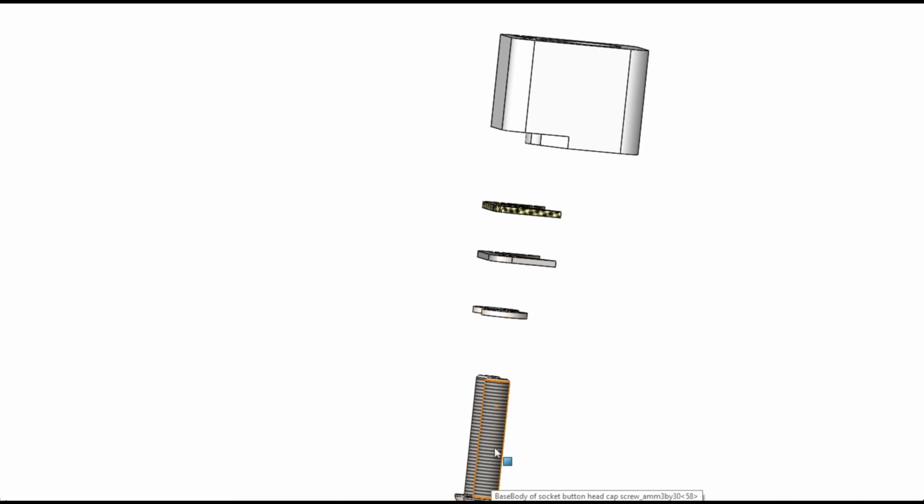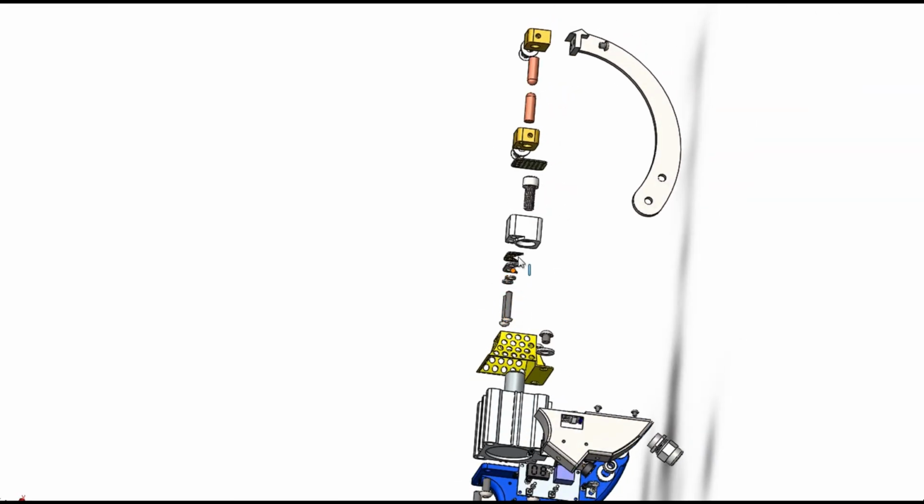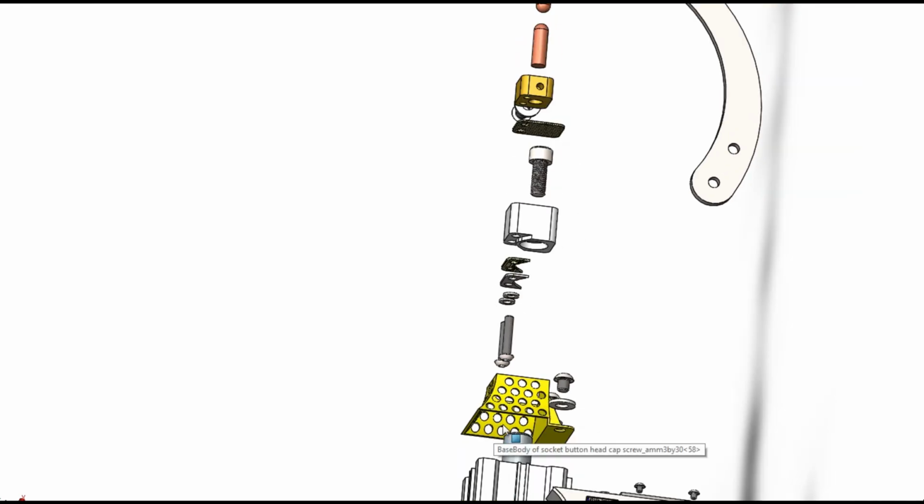Then there's two 35mm bolts, I think 35 or 30mm bolts, that hold this all together. These bolts go right up through the nylon block and all these wee washers, right up through this glass fibre board and into this brass block. So this brass block is tapped here and it is held tight. So when the pneumatic piston pushes the nylon block, all these wee components move together with the electrode.